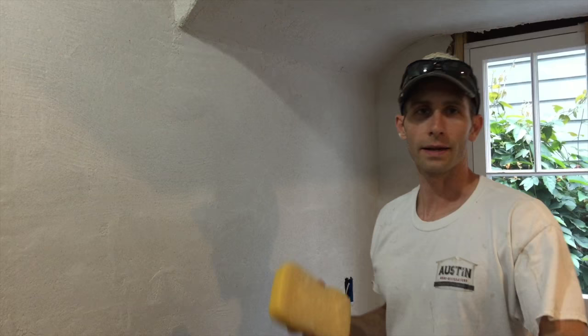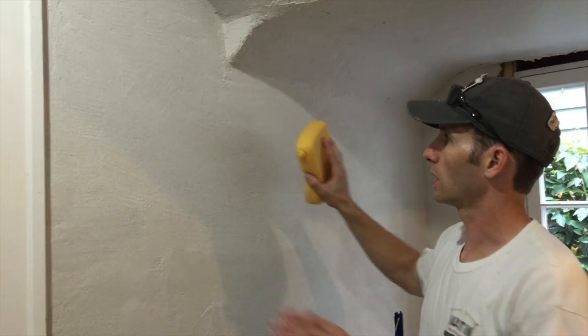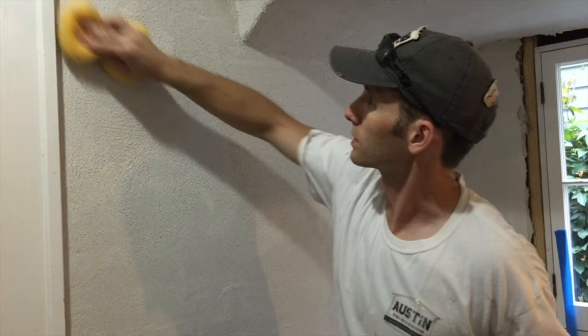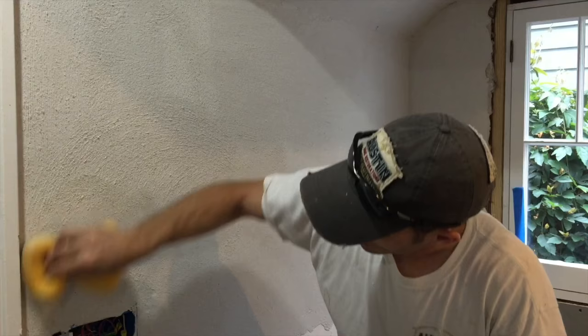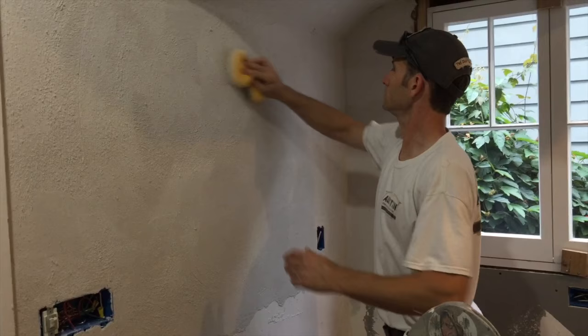We showed you how to put the plaster on and how to knock it down with the trowel. Now we're going to do a sponge float — this is just a finishing step to get the texture. On a sanded plaster this works really well. We've troweled it smooth and it's set up. I like doing a circular motion, but you can go straight across however you want. I think circular helps blend it in. You can see a lot of the inconsistencies in the plaster. If we were just doing a trowel knockdown, we would have knocked this down even smoother. But with the sponge float, I use it to get into the plaster, bring out the sanded texture, and smooth out all the other issues in the wall.